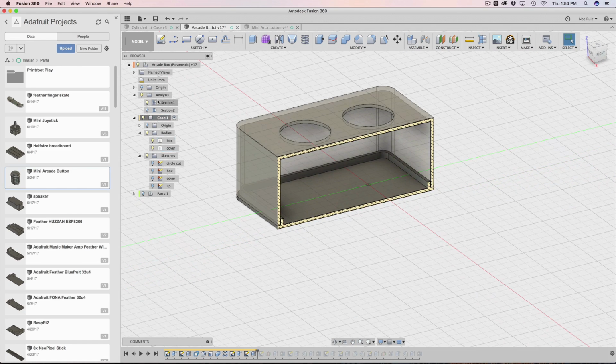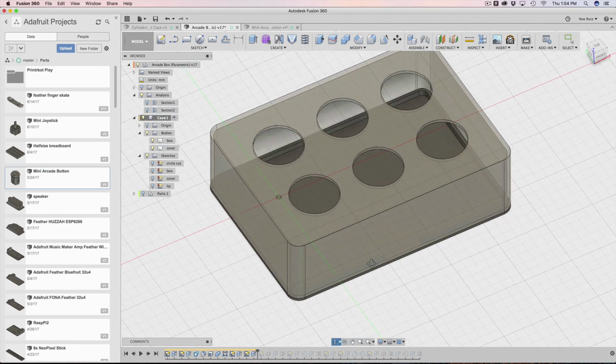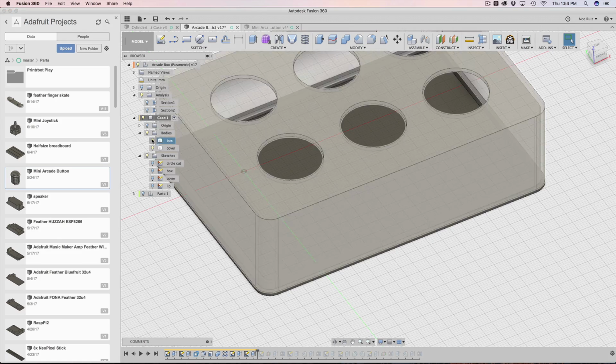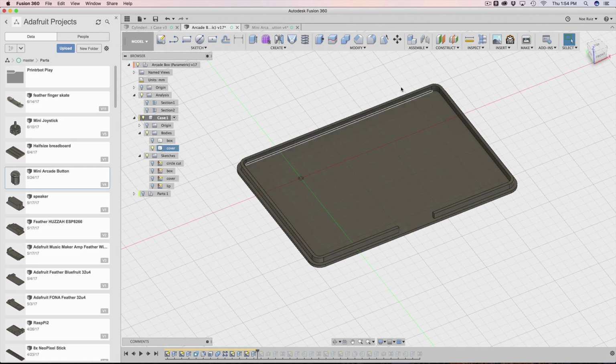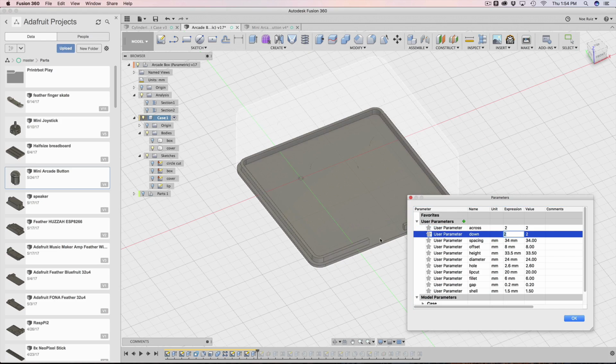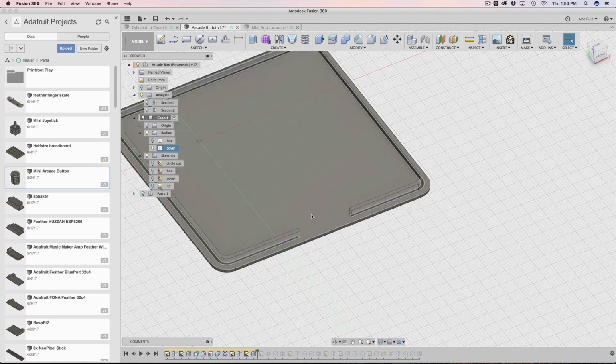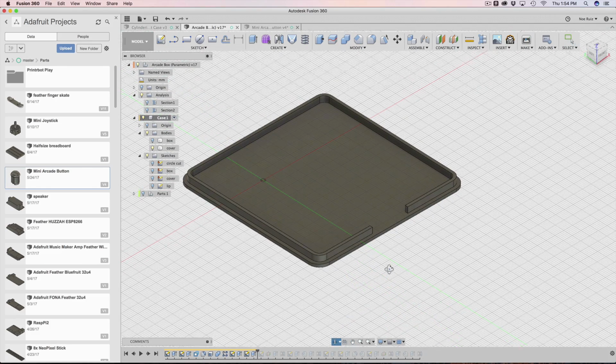And again, if we take out the section analysis, we can look for our lip and make sure that it is being cut where it needs to be cut, right? So that cut's still there. And maybe make this back to 2, and you can see the cut updated just fine. So the cut is maintaining its width and its positions, its midpoint constraint position.